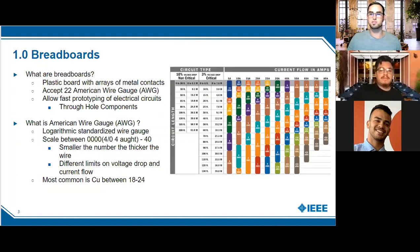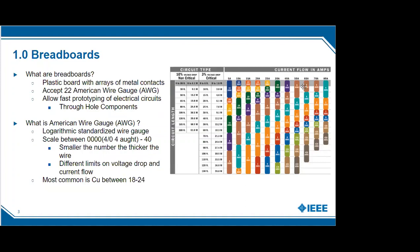So what is a breadboard exactly? It's a plastic board with raised metal contacts that accepts 22 American wire gauge wire, and it allows for fast prototyping of electrical circuits. It's very beginner-friendly. Pretty much after your first year you don't really use breadboards anymore — you do simulations first for your prototype because simulation is quicker. A lot of times the little prongs don't fit into the holes in the breadboard very well and it ends up being counterproductive.